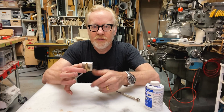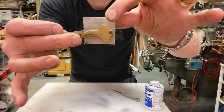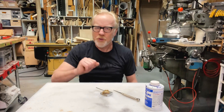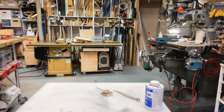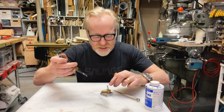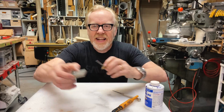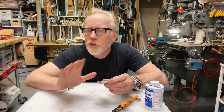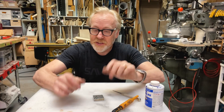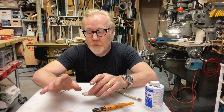If you want to cut this trigger out of, let's say, this chunk of aluminum — just for the sake of argument for this tool tip — you can see the piece of aluminum is big enough to accommodate it. But do I grab one of my Pika markers and sit there and trace it like this? No. Because it's just not accurate enough. I can cut close to that line and keep measuring, but when I am shaping stuff that has mission-critical dimensions, even a thin Sharpie doesn't come close enough. Plus, when things get heated, Sharpie tends to fade away under heat.